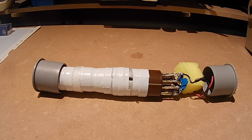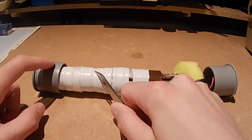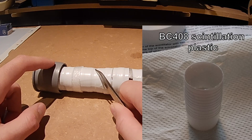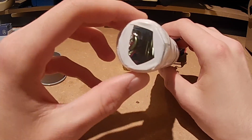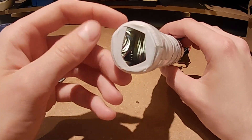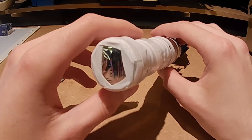So this is what it looks like on the inside. At the front is the main scintillation material — in this case, it's scintillation plastic BC-408, a 1-inch by 2-inch cylinder. At the business end, we see this shiny surface, which is aluminized mylar — two sheets of it — covering a zinc sulfide scintillation material that is in contact with the scintillation plastic.